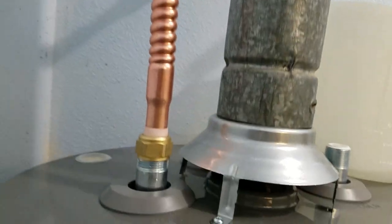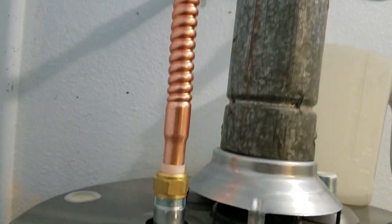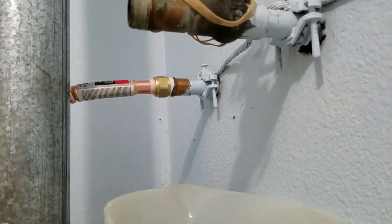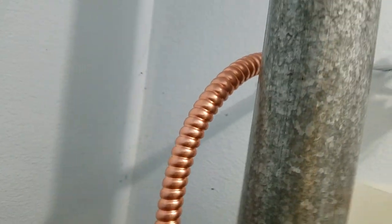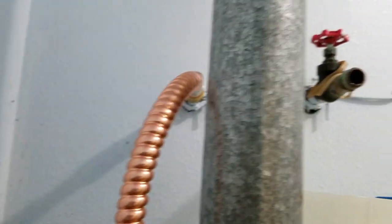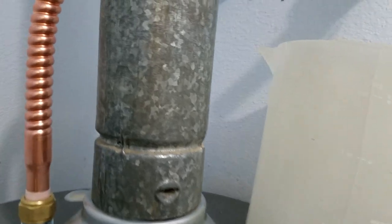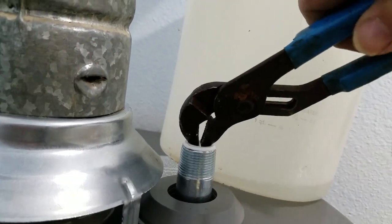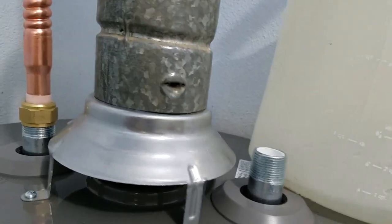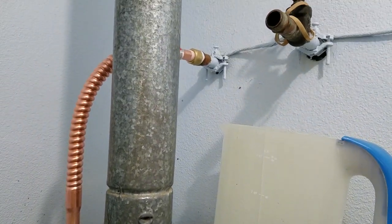So I've got the hot water out hooked up now — you can work this corrugated copper pipe really nicely. I've actually never used this product before, but it works really good and it's really easy to form. Let's do the inlet now. By the way, I should use some needle nose pliers or something to pull the little shipping plugs out of the fittings — don't forget those, get those out of the way. Alright, let's do the next one.